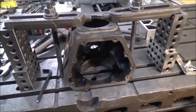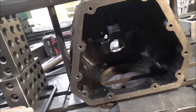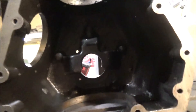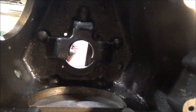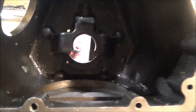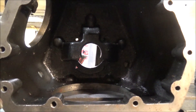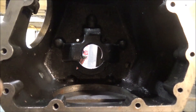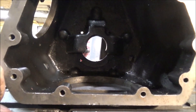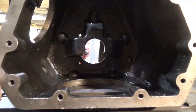Sadly, you won't be able to see most of this because of it being up in this hole, but basically what I've got here is a busted gearbox. The customer has several of these. Obviously it's a weak engineered design. That interior bearing support is not sufficiently supported, so any kind of side load on the shaft and it busts it out and junks the gearbox.